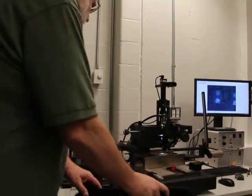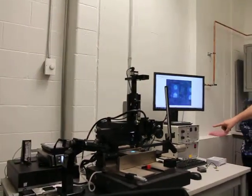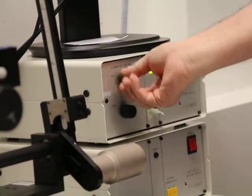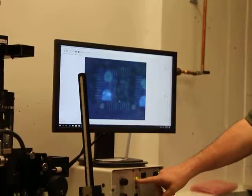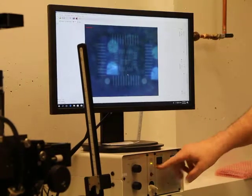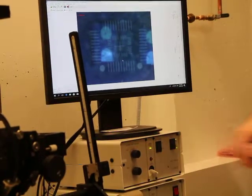So basically, you have this box here, which is a place control box, and this box turns your power on and off for the machine. We have lighting adjustments here that you can adjust for your lighting. You have a vacuum status here, and right now there is a die up on top on the head, which is what we refer to as the head, the placement arm. The green is solid, so that's indicating that there's something on the arm. If this was flashing green, that would mean that there's vacuum present, but there's nothing there. And when it's flashing amber, that means the vacuum is off.